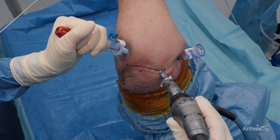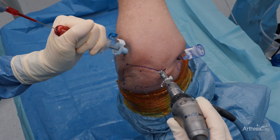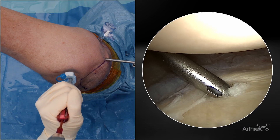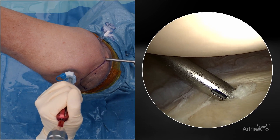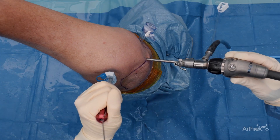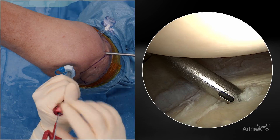We don't want to skive as we bring this across, and now we're going to drill at full speed and allow it to self-center. It has a positive stop. We allow that as we pull it out — we don't worry about stopping the flow; we want that fluid to flush that out.